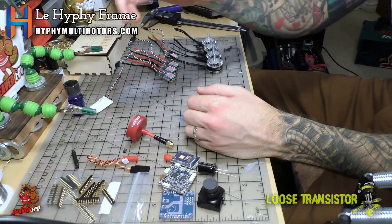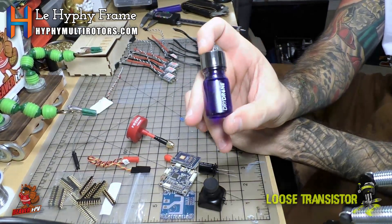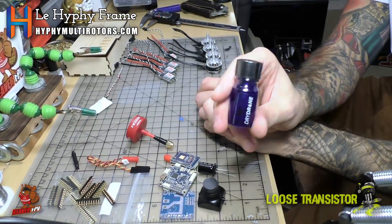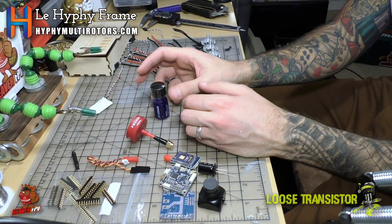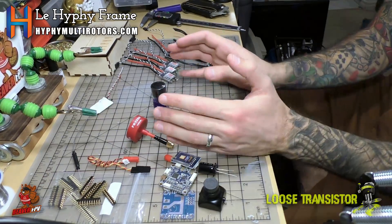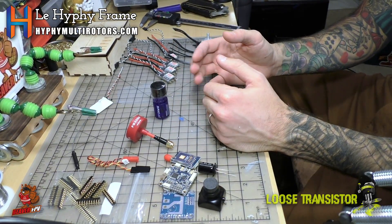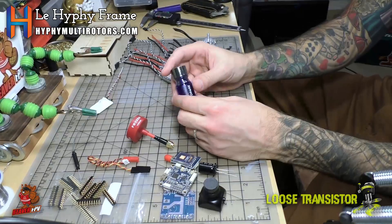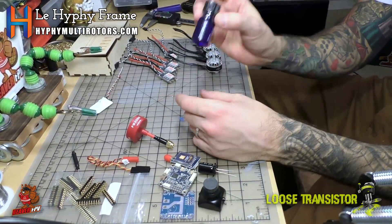We're going to be using Drydrone waterproofing on everything here. This is the new bottle Drydrone has just released — you should be seeing these on shelves very soon, complete with a website and technical information. I've been using this product for a few months now, flying in snow and rain, and it's protected my electronics very adequately. Most of the time I can just keep flying with no problem. In the worst case, some voltage regulators drop slightly when wet, but once it dries everything works fine. Drydrone has proven itself to be more than adequate for protecting electronics and I definitely vouch for it.